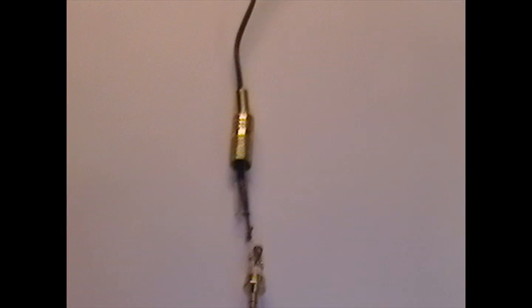The first thing you have to do is put the stress relieving wire into the housing and then pull the wire through that reliever and through the housing itself so that you can now attach it to the lugs, which of course are the terminal points on the plug itself. And I've kind of shown you that here. By the way, you can buy these plugs at Radio Shack. They're not hard to come by.